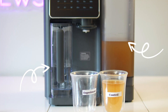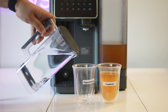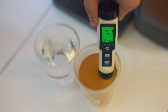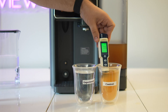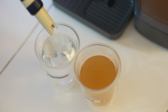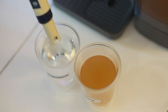As you can see, the dirty water tank shows the heavily contaminated input, while the filtered water tank is perfectly clear. The TDS reading was over 1800 ppm in the dirty water, dropping dramatically to just 54 ppm in the clean water. The pH level started at 7.75 and increased slightly to 8.2 — this is likely due to the remineralization filter adding alkaline minerals, which is normal and completely safe. Electrical conductivity also dropped from 3,450 to just 125, another clear indicator of how much was removed.